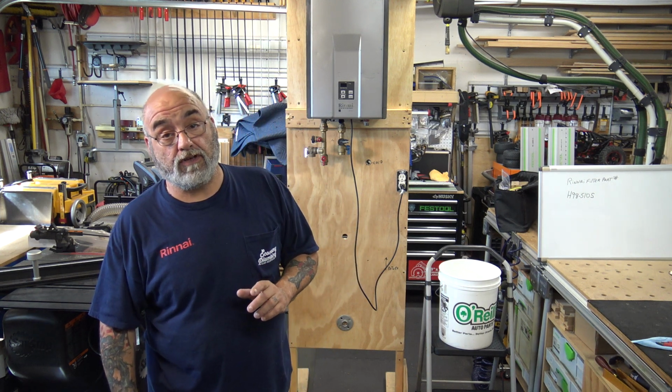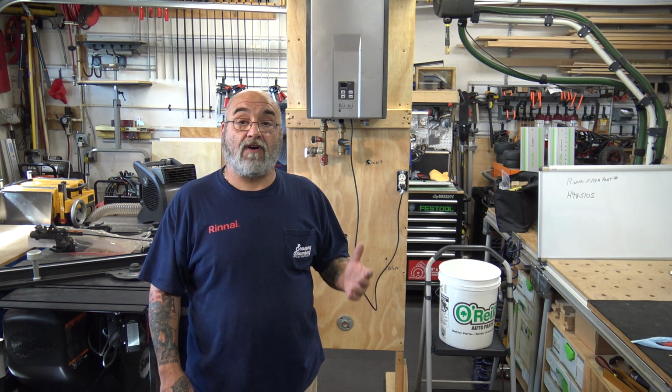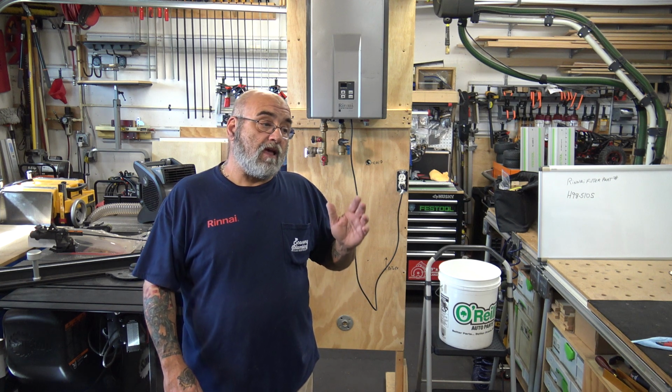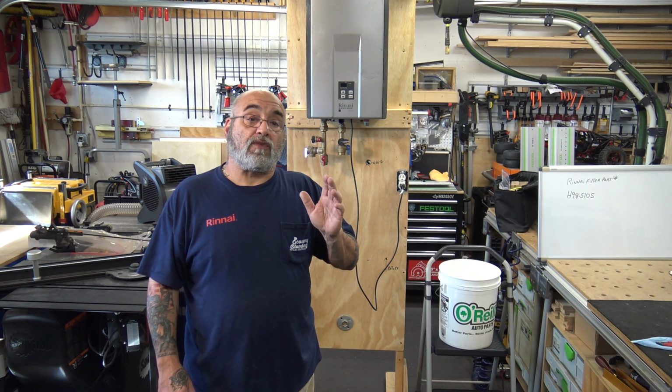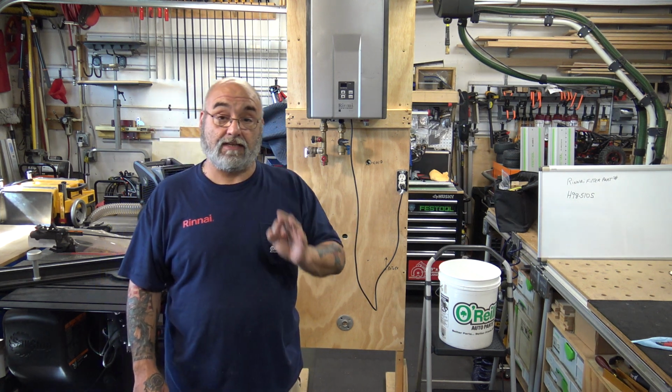Alright, today's video is probably one of the most important procedures that you are going to be doing on a tankless heater or Rinnai tankless heater, and that is the flushing of the unit. I get a lot of service calls from people that have either bought a house or have had a house built and live in there for a few years, and then they find out that these things need to be flushed. If you go into the manual, you'll see that there is a page on just flushing the tankless heater. They should be done every year.